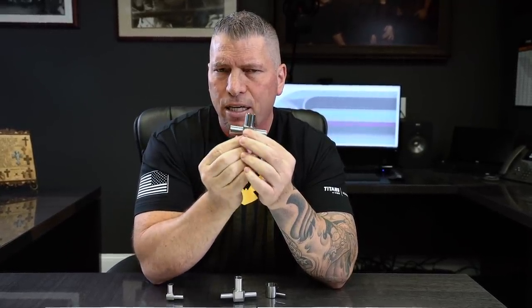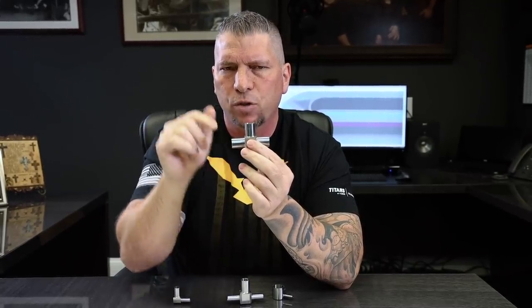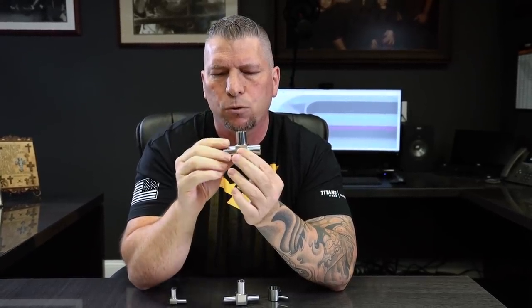Standardized tooling — your end mills and drills are each picked specifically for these parts. In your tool library you might have a tool specific for 316, and one specific for Inconel. I go with the Go Drill from Kennametal because it handles all of them in different sizes. For oddball shapes I use end mills to open them up so I can quickly make adjustments, then set the bore bars and finish everything — make it beautiful.